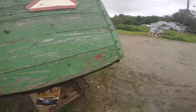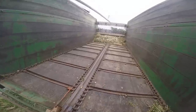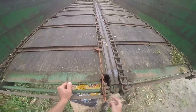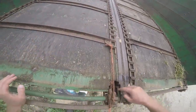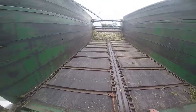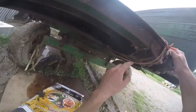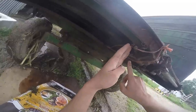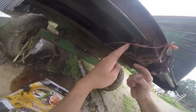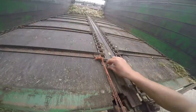Now we can get in there. I still got to shovel that out just in case I need to move things around. They're just totally adjusted out, so hopefully I can make these links shorter. The chain got too loose up front and there's not enough clearance. So when it rolled around that corner - essentially what we've got going on here - it would come around the sprocket, get caught, keep pushing, and break the link off.